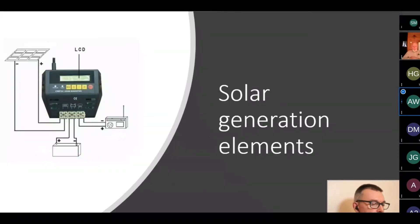This diagram shows the various elements of the solar solution: the solar panel, the battery, the appliance supply, and the controller in the middle. I don't run appliances directly off the controller because that limits you to the controller's current capacity — mine is 10 amps. Instead, I run directly off the battery through a series of fuses.